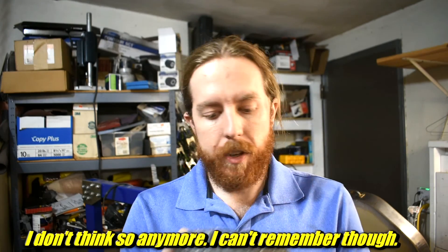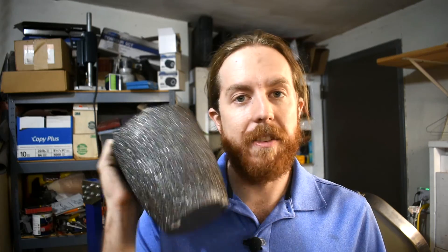My goal with both of these crucibles is to just use them for aluminum and zinc alloys — low temperature melting things. I'm going to temper them at a much higher temperature than aluminum, let them cool off. They will then be fully fused and I will never get them that hot again. They'll probably be 500 degrees shy of what I'm going to heat them up to. As an example, here's a crucible that I tempered before — I've only used it for aluminum, and it looks pretty good. It hasn't changed much.